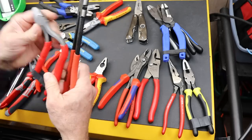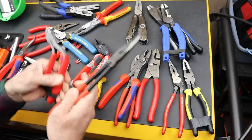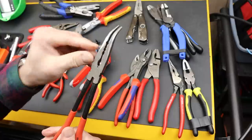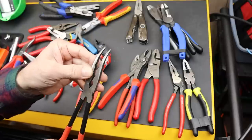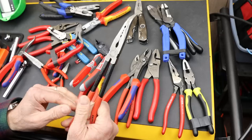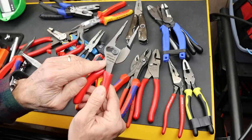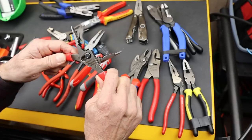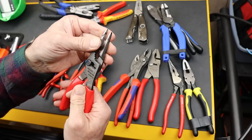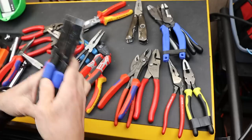Next — you can bend the tips, which is different from a pistol grip: it actually changes the angle. If you bend the tip, you can have extended reach, a bent tip in a needle nose, bolt grabbing various, stock grabbing, square stock grabbing — but no cutters, so we've managed to wedge quite a bit in there. Snap-on in their triple joint pliers — both the 47 and the newer 46 — they've put small cutters in them, bolt grabbing, crosshatch all the way through for a needle nose.